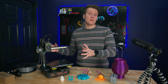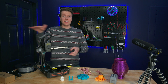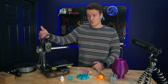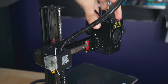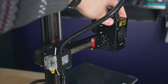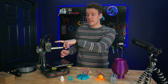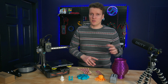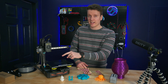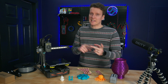The design here is different than most 3D printers. Most 3D printers have the standard upright — two uprights and a crossbar on top. This one only has a single vertical crossbar. It's really well built and really stable. The linear rails are the big bonus here, and it all works because they're using linear rails on the x-axis and the z-axis. That's an easy way to identify the Pro from the regular version. The Pro has linear rails on the x and z-axis while the regular version has linear rails on the x and y-axis.